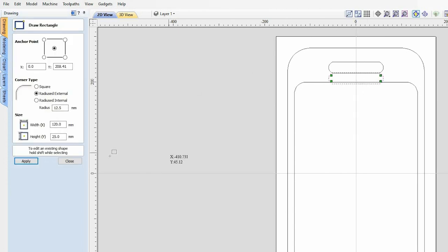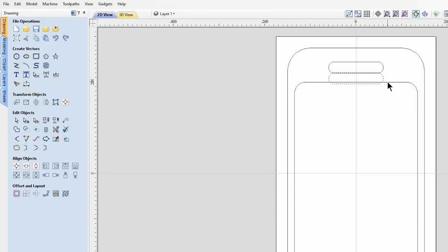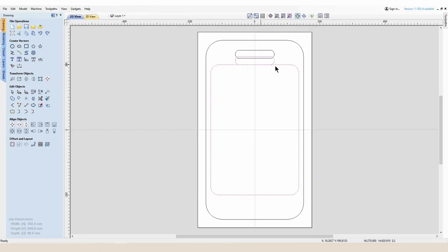I'm going to create another one of these handle vectors and use that 25 millimeter width as a spacer. I've got this mock handle vector selected and I'm going to select the vector of the bowl and use the alignment options tool. That's now perfectly spaced at each edge. I'm using that mock handle vector just as a spacing tool, so when I deselect and delete it, I'm now perfectly 25 millimeters spaced between the handle and the internal bowl vector.